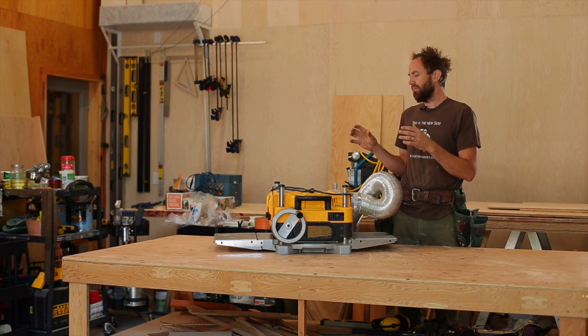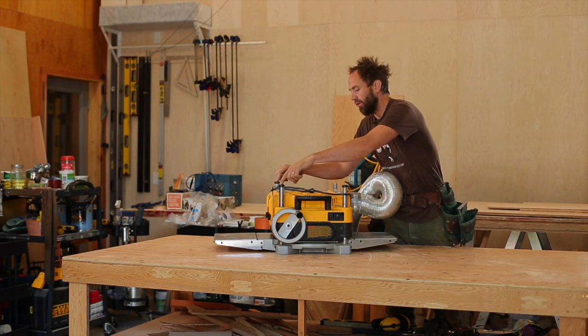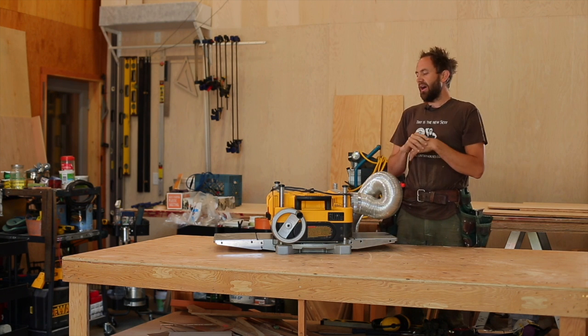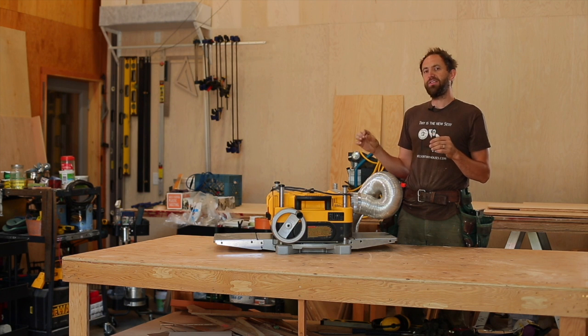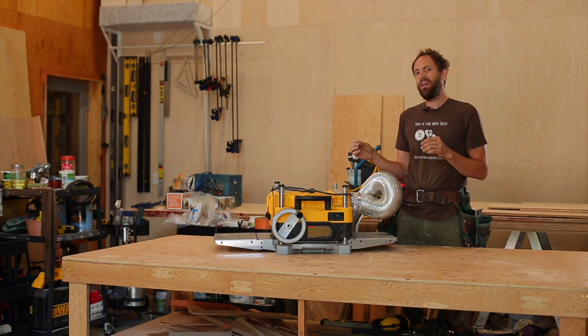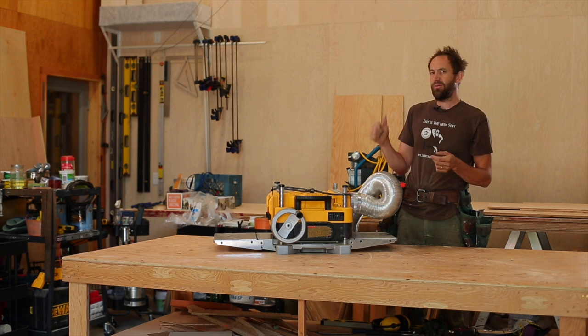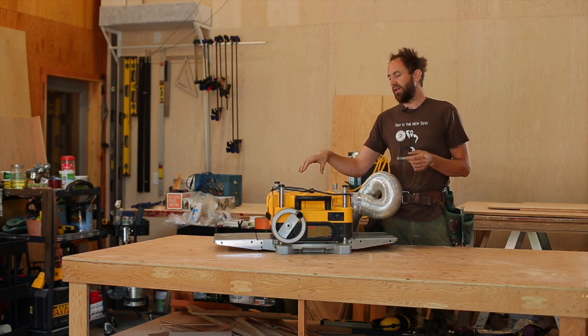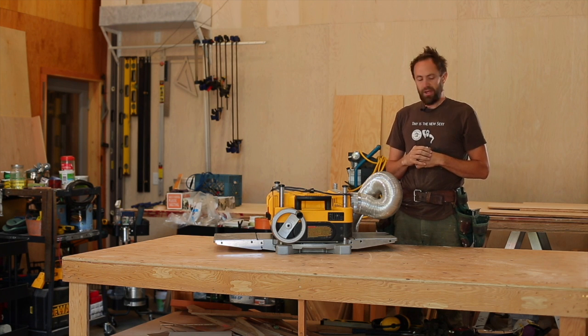If you do buy a thickness planer, one thing to look out for is that it has 4 points where it goes up and down. I've had many of the other ones and burnt through them all. The other thing is the blades do get dull pretty quick. They're expensive, so you tend to put off replacing them, but by doing that, you're putting a lot of extra strain on the machine and it'll burn out a lot quicker.